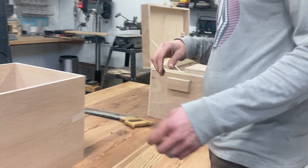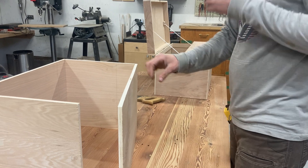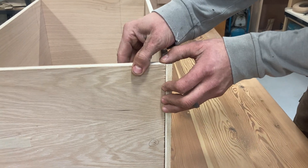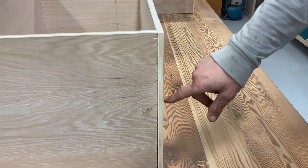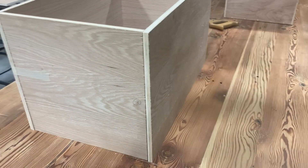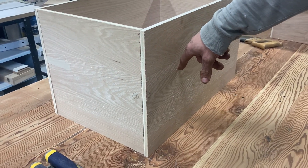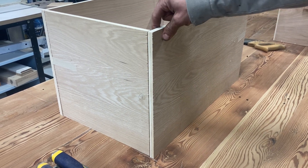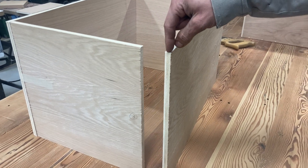Since it's Amish Thursday, we're going to make our first rabbet by hand. Looking at the pieces lined up for your box, you've got them all numbers matching and the grain wraps around the blocks as much as you can. Remember, this is going to be the outside of the box. So all your rabbets have to be made on the inside of the material.